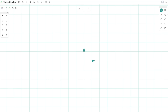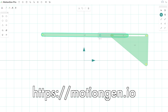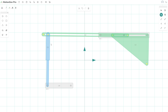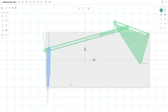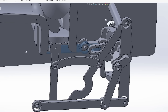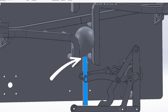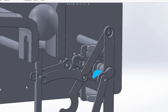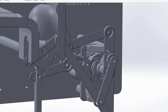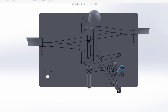Luckily I recently found this tool called Motion Gen Pro. This is not sponsored — they probably don't even know I exist. But it changed the game for me; it let me draw the mechanism really quickly and get a better idea of how things were going to move. I decided to work backwards, starting at the paddle and working my way to the trigger. When the ball comes down the shaft it's going to hit this post, push on this link, which pulls this link back, releasing the paddle connected to the crank arm of the mechanism.